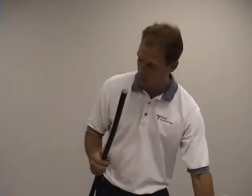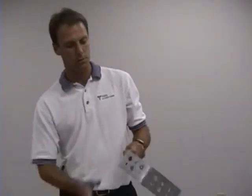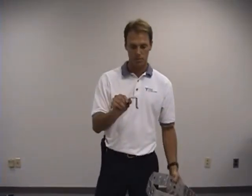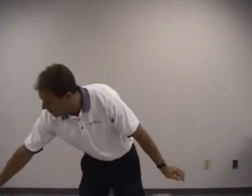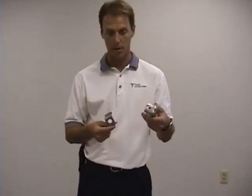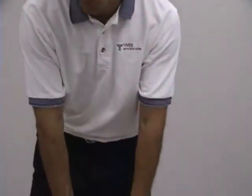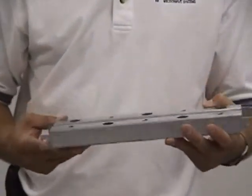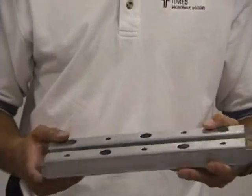This is just a piece of metal with some holes in it. You're also going to have things on the job site — you'll see cluster brackets, stand-off adapters, angle adapters. They all have a three-quarter inch hole. That's where the snap-in hanger is going to be used. For a rooftop application, you'll see rooftop sleepers. Anything with a three-quarter inch hole, the snap-in hanger is going to work just fine.